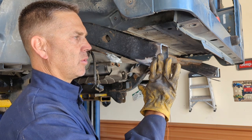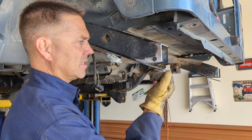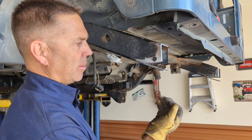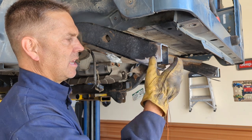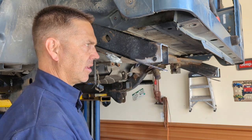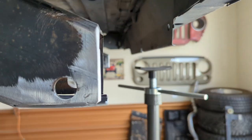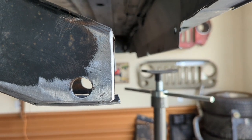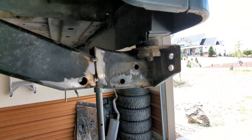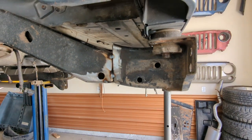We're going to back it all up with fish plates when done, but in the meantime make sure you get full penetration welds on all four sides. Thinking back to last time, when we bend up this part of the mouth, there'll probably be about an eighth of an inch sticking out beyond this, so before putting on the rear cross member I'll set it in place, get it tacked on both sides, trim as necessary, then get the cross member in and tacked up. Double-check everything one last time before burning it in. You do end up with that little bit of stick-out, so take the grinder, cut that off, and then get the cross member mounted. Once fit-up is complete, tack weld everything, verify fitment, and burn it in.